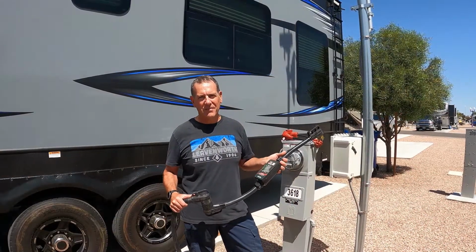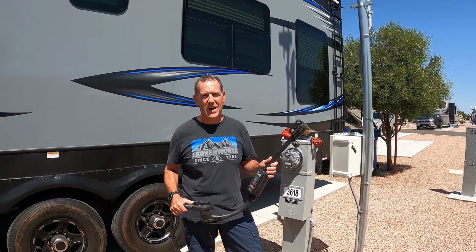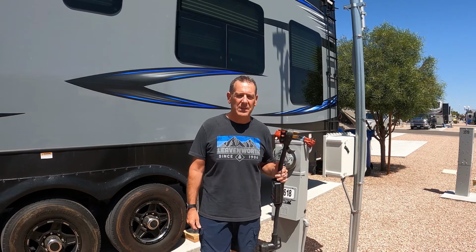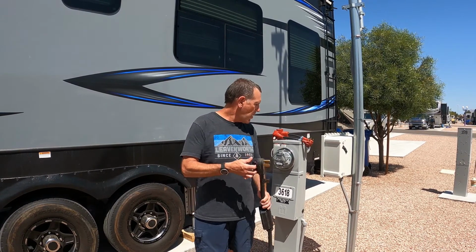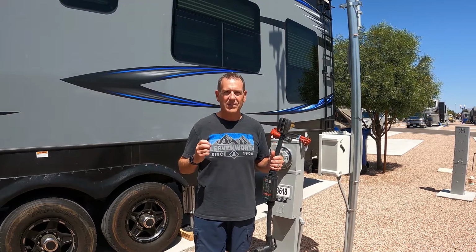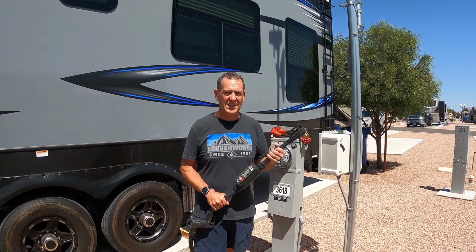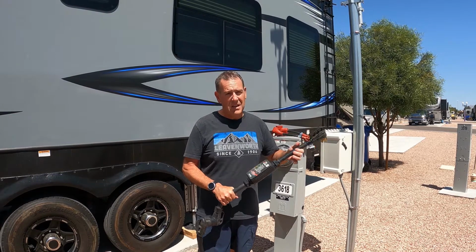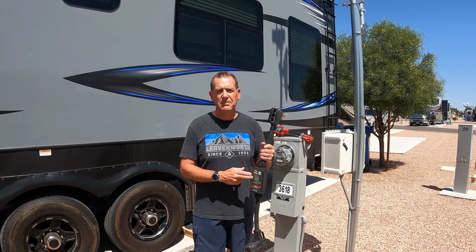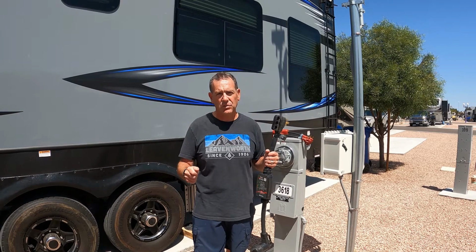All right, I know everybody in your family's in a hurry to get power in the RV, but you need to take your time and make sure everything is right, or damage can occur. It wasn't long ago we ran into some people in an RV park that had a story about some arcing that was going on inside their post, and they did not have a surge protector, and it took out their air conditioner and the refrigerator. So a couple thousand dollars worth of damage, and I highly recommend a surge protector. We use the Power Watchdog, and it has Bluetooth connectivity, so I can set alerts for power surges, and I also can monitor our power use.